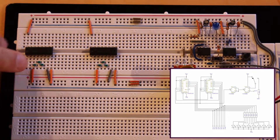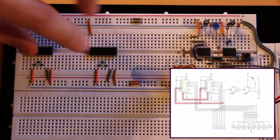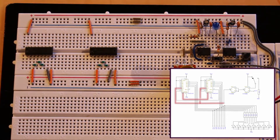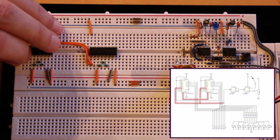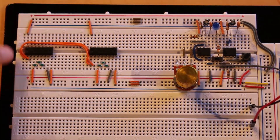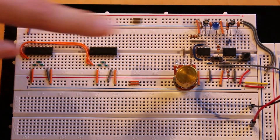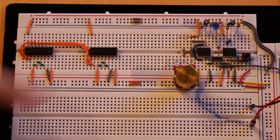Pin 2 is the clock input and pin 1 is the master reset, so both of those need to be tied together for both chips — I just need to run some jumpers connecting those two together. For now they'll stay hooked together and we'll deal with hooking up to the clock, as well as figuring out a reset, a little later.